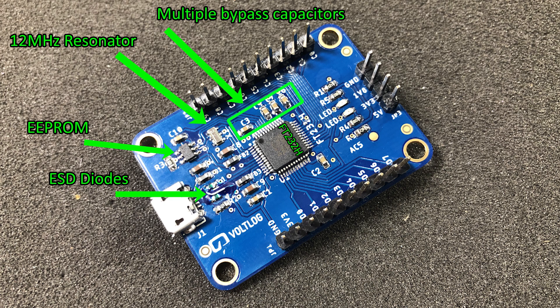The chip will still work even with a blank EEPROM or without an EEPROM, but if you want to use some of the advanced functions, you can save the config in this EEPROM, so it's nice to have it on the breakout board. The IO pins are 5V tolerant, so you can connect this to an Arduino running at 5V as well as a Raspberry Pi running at 3.3V.